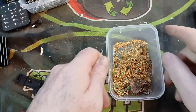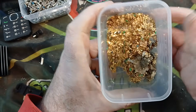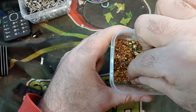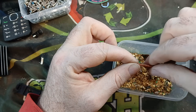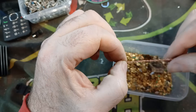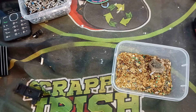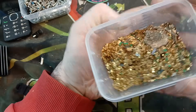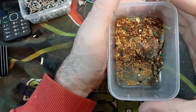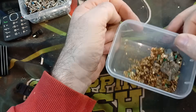Here's the gold after filtering from the copper chloride solution. You can see our gold material in here — it looks like a lot but by the time you refine it down it reduces. There's even a little bit of copper that got in there somehow. I'll get that out — we don't want it mixed in with the gold. No gold left on it, good. Well spotted — it wouldn't have made a huge difference at the next stage, but we don't want to waste acid dissolving copper when we want it working on this gold.